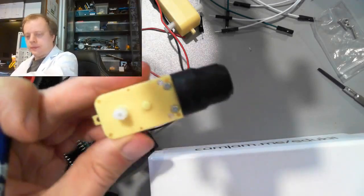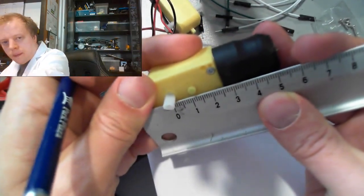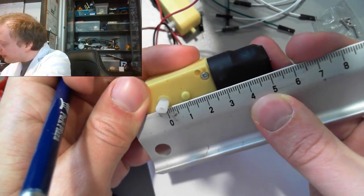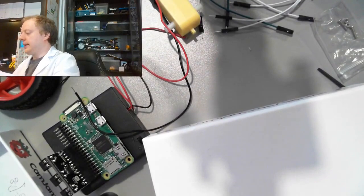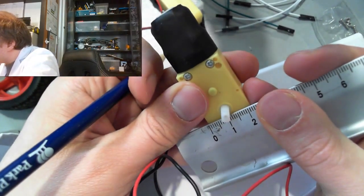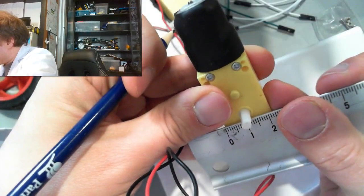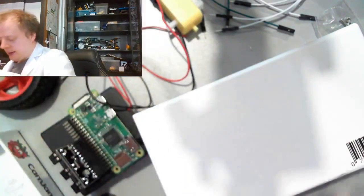Again, this is going to be a rough measurement, but if I'm trying to get from the centre of that axle out to here, are we saying 52 here? I think that's about 52. So again, I mean, this is going to be hot glued, so 50 might be close enough, but we'll try to get it closer than that, so it's going to stay fairly firmly. And if that's the case, so that's 11 or 12. I take it tangent to that circle. That's about 11.